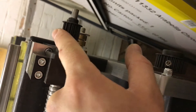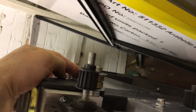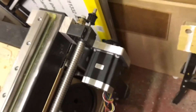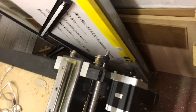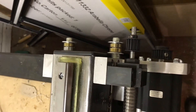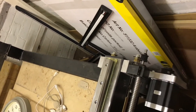The belt will also run around here, around this idler, around this one, and then back around again. I've ordered all of these and I'm going to get them fitted. Then I'm going to run a piece of string all the way around to measure up exactly how long I need the belt to be. I have got it all drawn out on the computer, but I figure it's better to be safe than sorry, so I'll just measure it in reality as well.